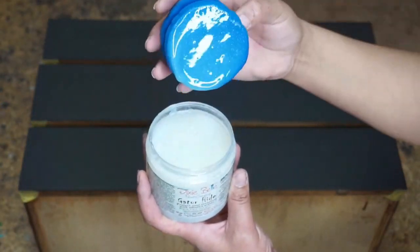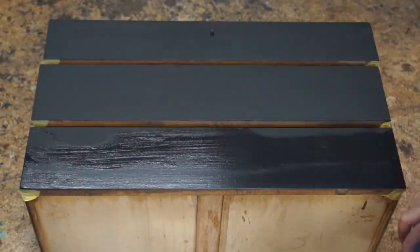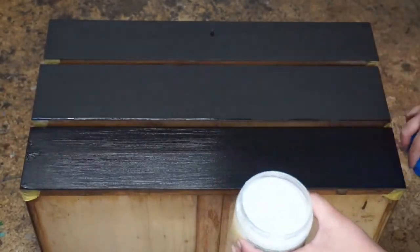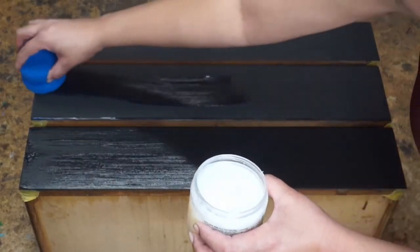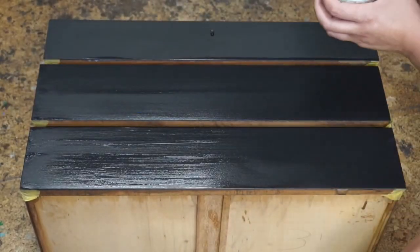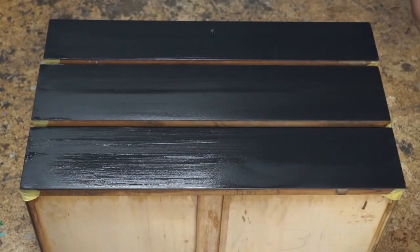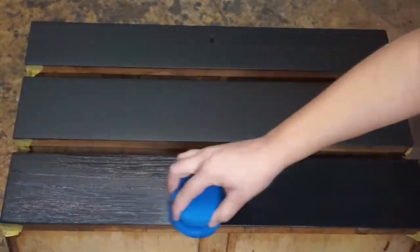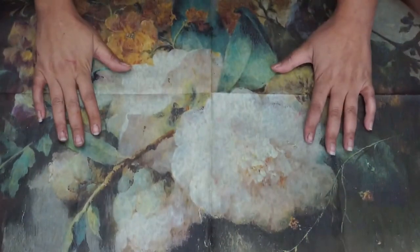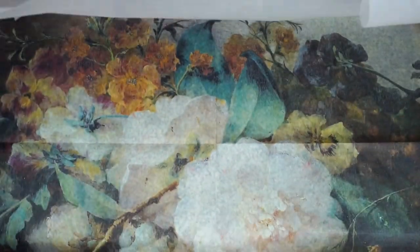For the drawers on the top half I wanted to add some decoupage paper. There are many ways to apply decoupage — in this case I will be using the iron-on method. I started with two coats of Dixie Belle's Caviar for my base, and once dry I am using Gator Hide accompanied by a blue sponge to give me a smooth, stroke-free application of the clear coat. We will be using this Gator Hide as our glue. Once I had one coat complete I let it dry for about an hour before adding a second coat, then waited about another hour before laying out my decoupage paper.